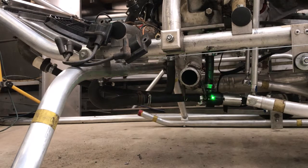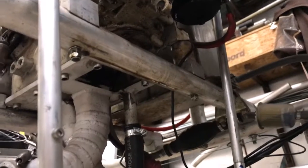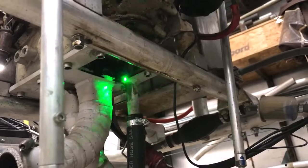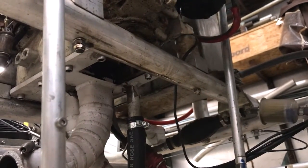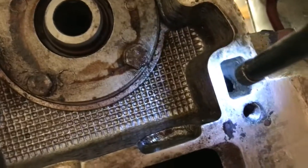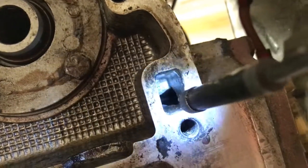Let's take a look at the coolant passageways on this 1981 60 horsepower Johnson and how I've got it connected to the radiator. Coolant comes out the bottom of the radiator and along to the water pump. The water pump pushes the water into the engine through my manifold, and this is the hole into the engine. Notice it's restricted and not free flowing.